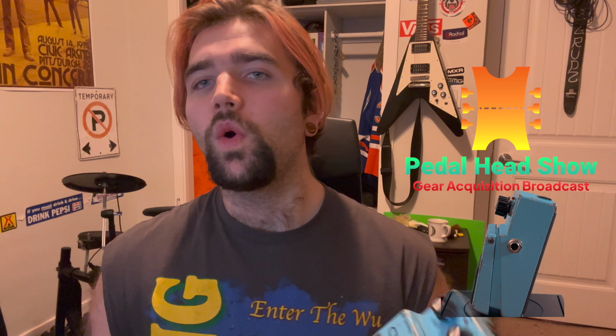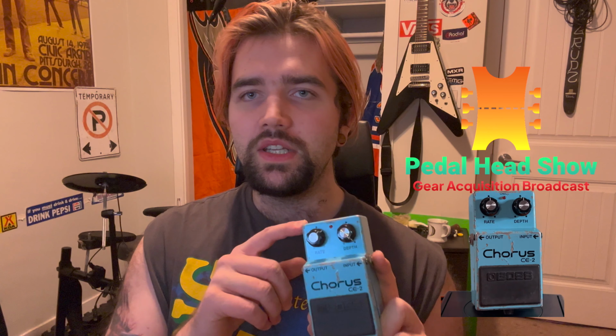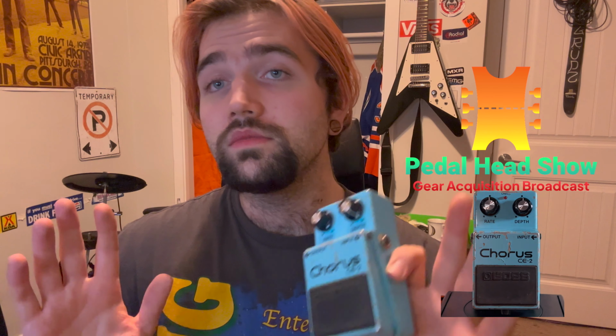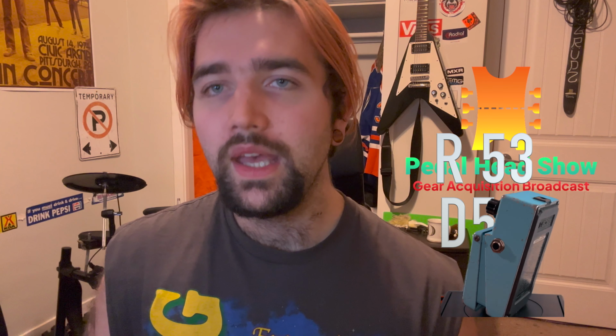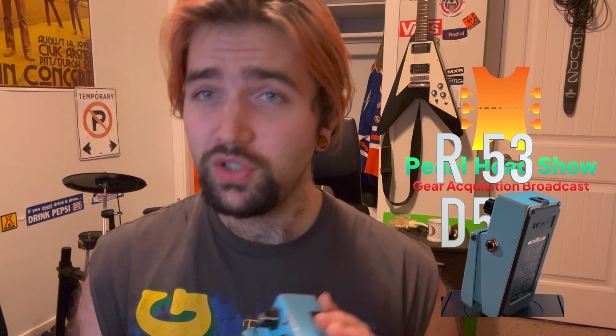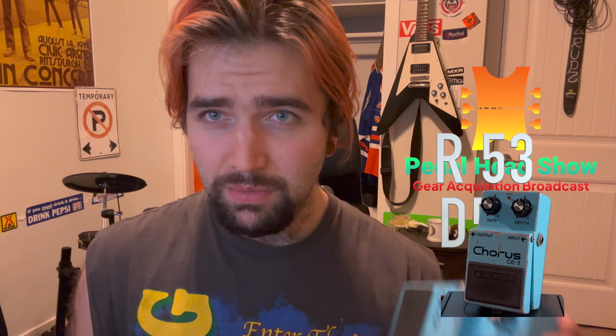In order to change the CE-2 from 12 volts to 9 volts, we have to remove or jumper D5, diode 5, or resistor 53. Now, the only thing that's difficult about modding a CE-2, especially an old one, is that they're not labeled.